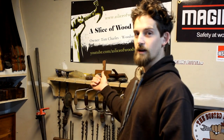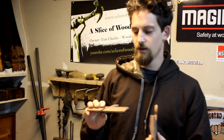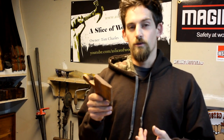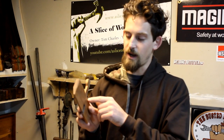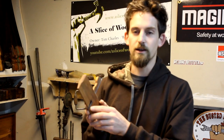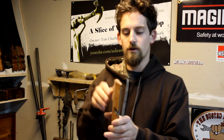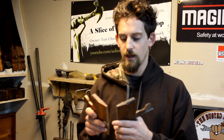After looking at one of my takes on this video, I noticed one of the tools I made in the background - a side cutting plane to match this other one, for when you have a dado and you need to clean up the edge. This was a fail. It worked at first and just didn't work well afterwards. The concept is great, except when I put the hole through the middle it didn't line up correctly, so the blade instead of being flat with the side kind of goes inward. I just need to make a new one to match this one and it would work perfect. The blade is perfectly fine, still sharp - it just doesn't cut because it doesn't hang out of the side.